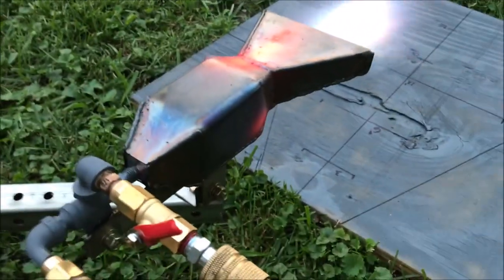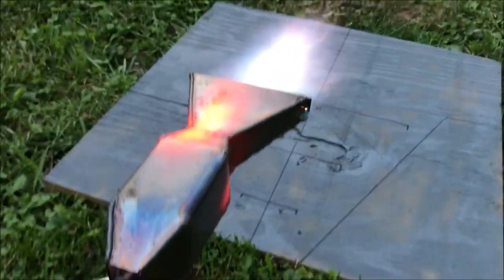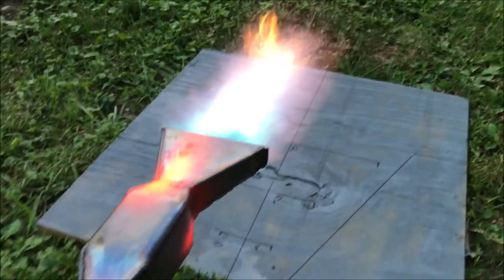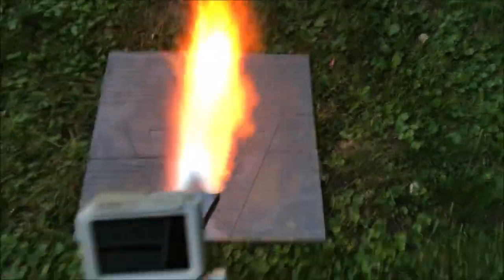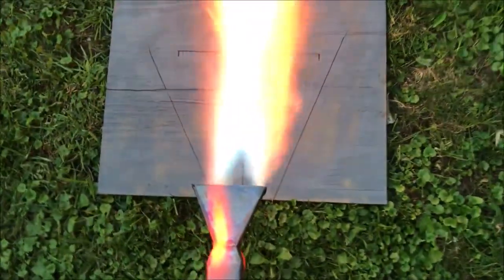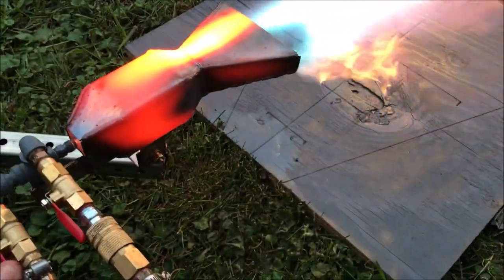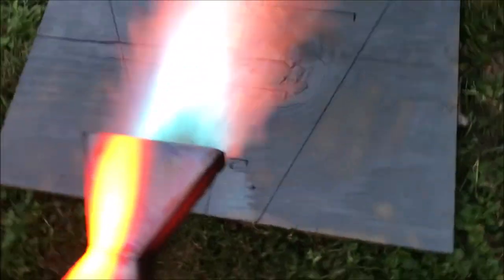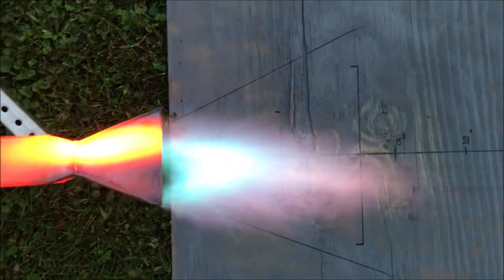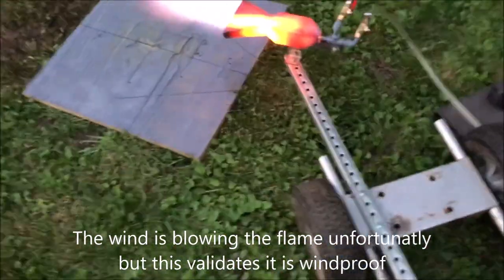This condition is self-cleaning — the burner will clean itself as it runs. See how we're starting to get the right side red hot. I definitely want to adjust that nozzle to avoid any irregular combustion byproduct buildup. Now I'm turning it back up — that flame is just too cool. There it is right there, that's self-cleaning mode. Definitely need to adjust that nozzle, but cool as heck nonetheless — I'm really liking this thing.